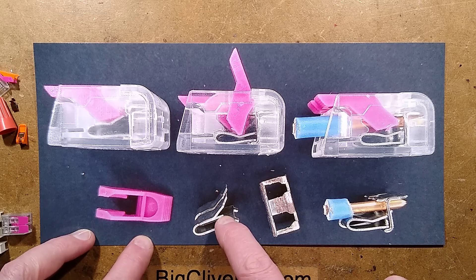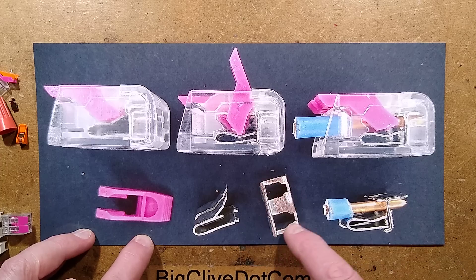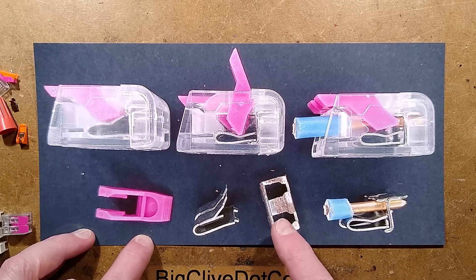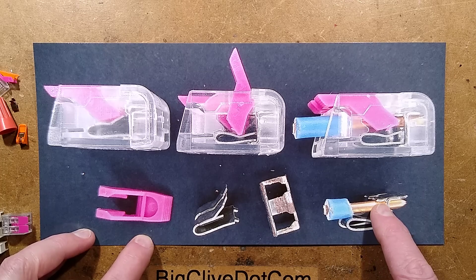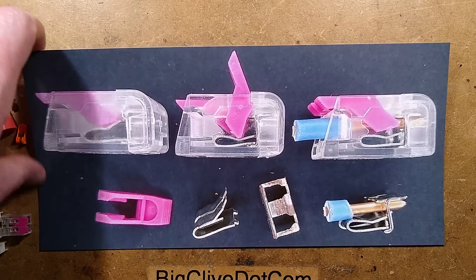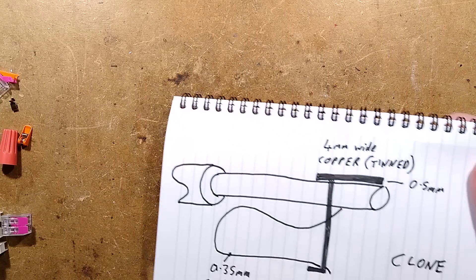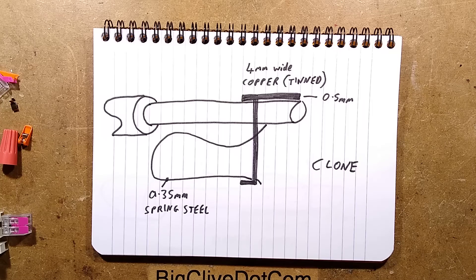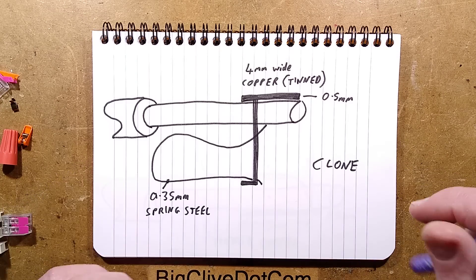Both contacts are connected together — and this is the main difference between the clone and the original WAGO terminal. There's the little bus bar; it's also copper, looking scuffed because I took it apart. That's what it looks like inside, with the spring pushing up against the wire. Let me show you a graphical representation which will make this easier, and then I'll show you how easy it is to put the clone back together again. Unlike the original WAGO, the clone is a nice design, I have to say.